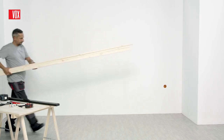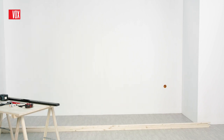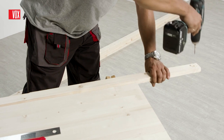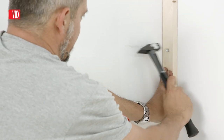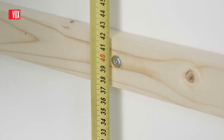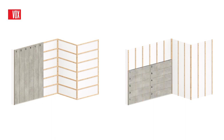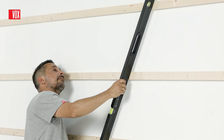One possible way to install the Cara Deco wall system is to install it on a substructure. The panels are mounted on a frame made of wooden battens, which should be made of good quality wood attached to the wall in a reliable and solid manner using screws suitable for the type of surface. The battens should be spaced at 40 centimeter intervals and mounted perpendicularly to the direction of the panels. If the panels are laid vertically, the battens must be arranged horizontally and vice versa. All battens should be leveled using a spirit level so that they form an even plane.